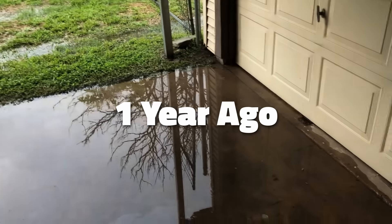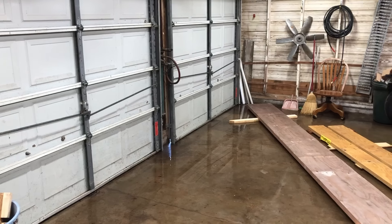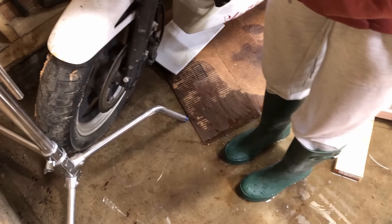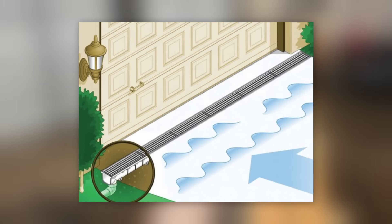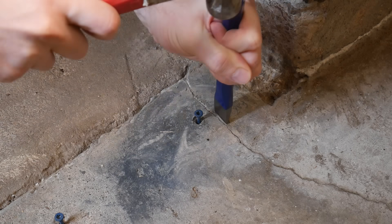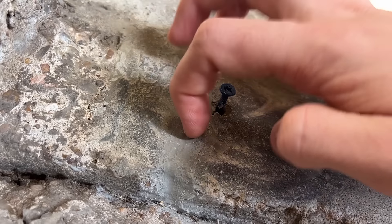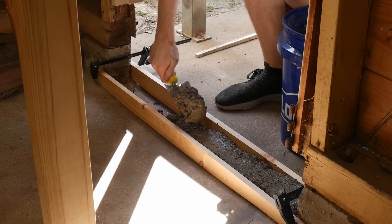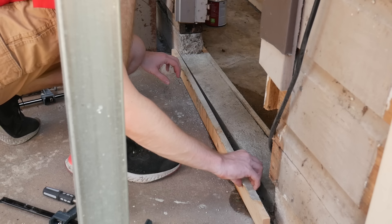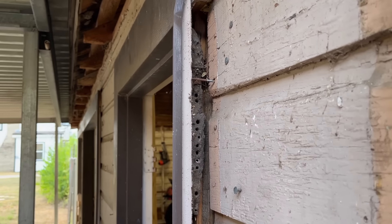Now they still have to cure for a full week before they're strong enough to build on, so because I have to wait anyways, I can use this time to fix another problem. Rainwater pooling in the driveway has proven to be a lot worse than just annoying when it gets severe enough. Eventually, I need to install some type of drain out front, but to do at least something about it now, I figured it might be a good idea to also pour a tiny concrete wall at the base of the doorway, though not before chipping away and repairing a crack with a specific crack filling product. This will also create a raised uniform surface for me to install a brand new sealed door onto. But first, I gotta tear down this entire wall.